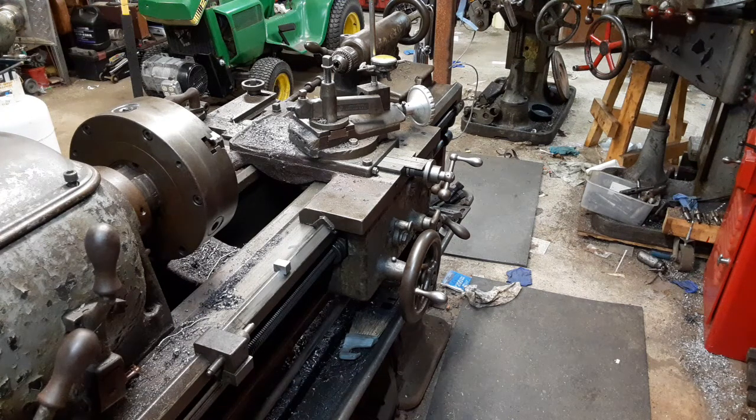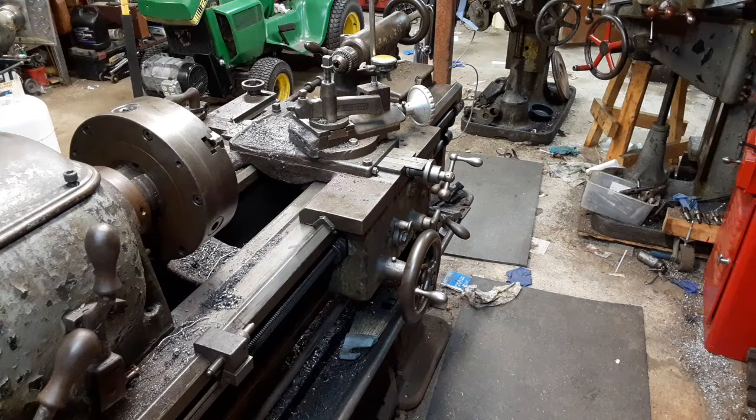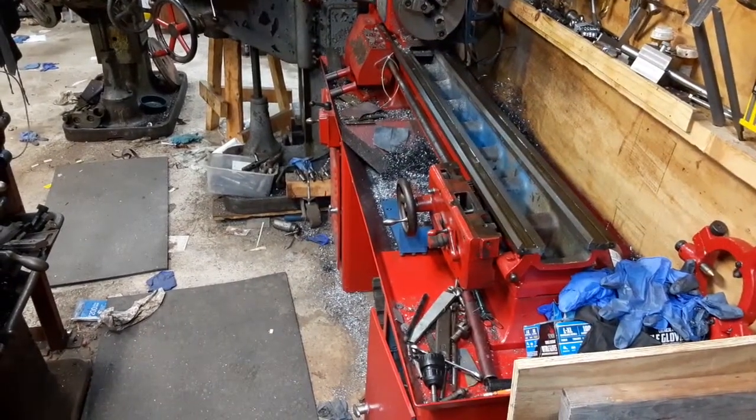I also took this little device out to the other property and measured the wear on the other Logan lathe bed, and it was about six or six and a half thousandths of wear - six and a half thousandths of difference. So anyways, that makes me pretty doggone optimistic about this Logan lathe, or at least about this bed.